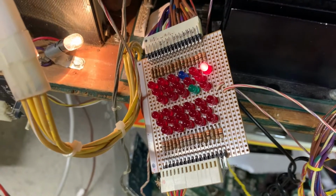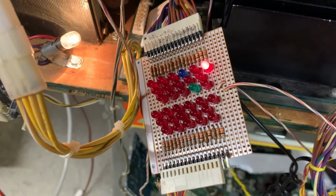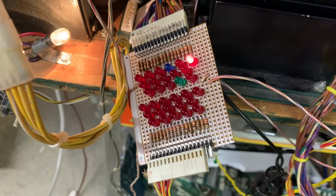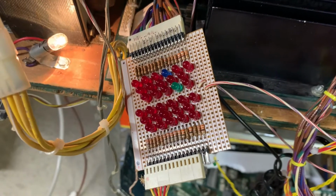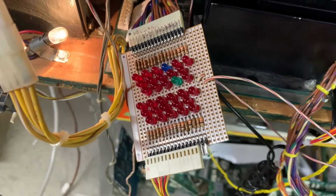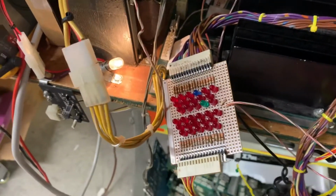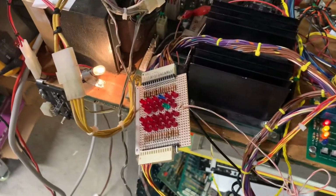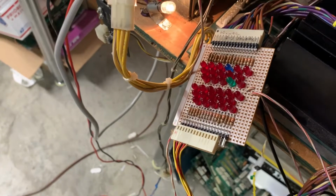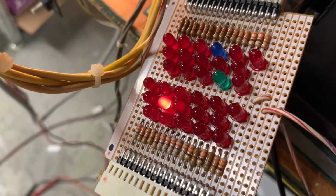Where I had the particular problem with this was that there was a 7408 that was blown out, and I was following the trace or the logic path there, and I eventually found it. This solenoid, the second special solenoid, is Q4. So what happened was, whatever happened, the coil or the transistor failed, and then it fed back into the special solenoid. So I can check the switch drives for these solenoids after the CPU controlled drive goes.